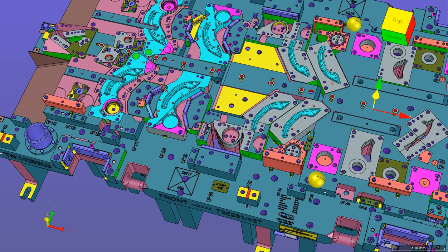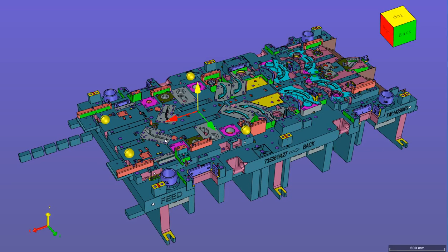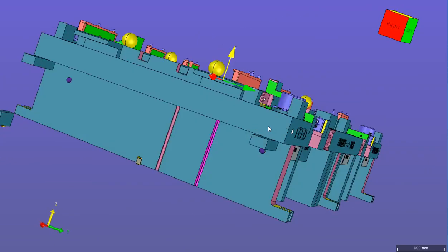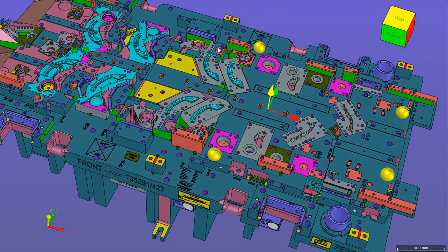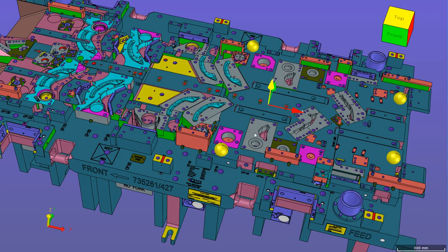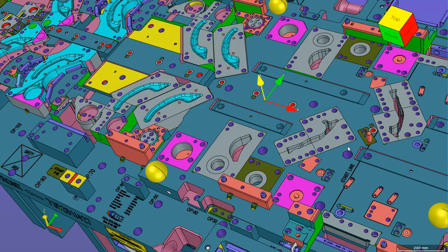Now let me show you the construction of the lifter plates. We have some lifter plates and lifter pins in this die. When the ram goes up it lifts up the strip or coil so the coil can progress forward without being interrupted or interfering with the form steel or any other lower die element. The preferred material is P20 prehardened steel; if very large we can use C45. The lifter plate must have a minimum of two guide pins, minimum three gas springs, and minimum two retainers.